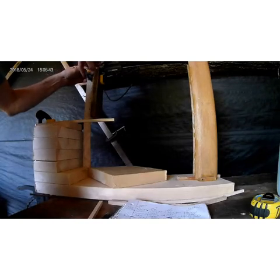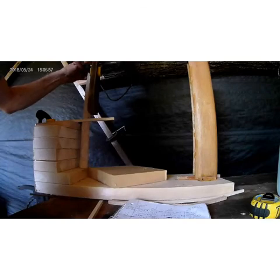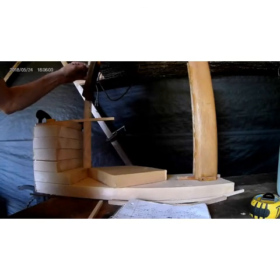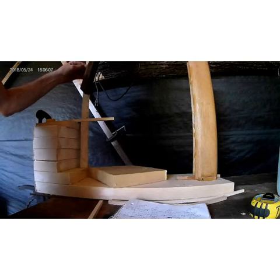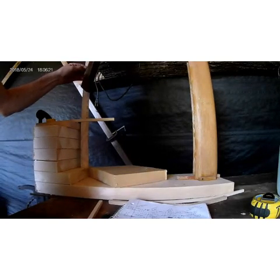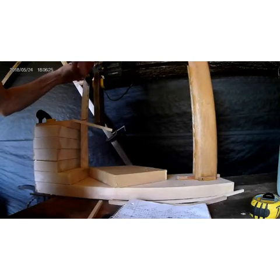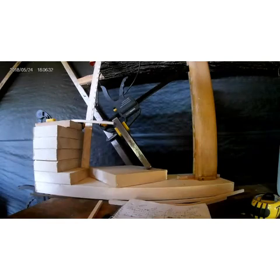Now we're testing the common white ash from Wooden Aviation in Missouri. All of these woods weigh exactly the same — the ash is reduced in size to match the Sitka spruce. Skipping ahead: at four inches, I thought I heard a crack. Repeating the four-inch drop, it cracked — but the ash is still very strong and won't budge further, unlike the Sitka which snapped clean off.